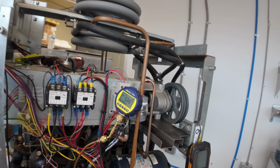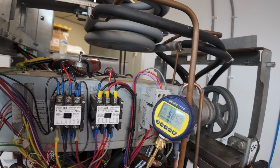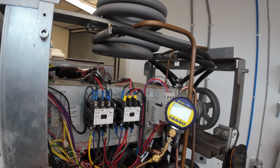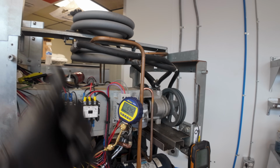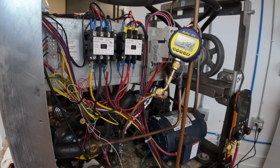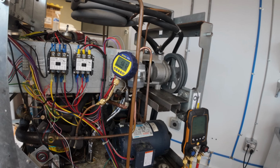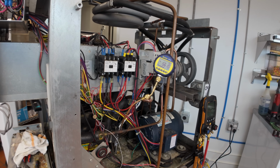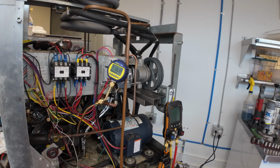However, I've had leaks, even though I pulled perfect vacuums and held for quite a long time. So you can't trust vacuum for a leak check. Same thing on it goes up. So refrigerants in the oil, it's going to boil off. I don't have all day to boil refrigerant out. We'll watch it. We'll see how it does first before we get to that. But you got to make a judgment call on some of those things.